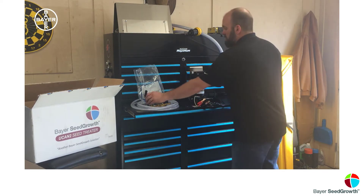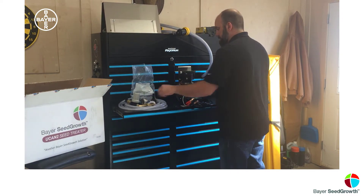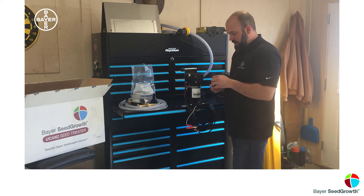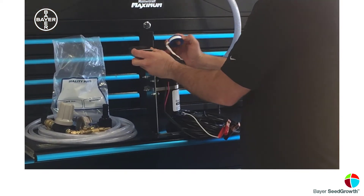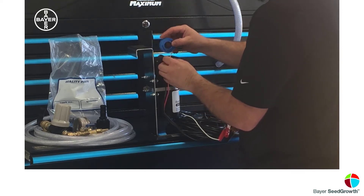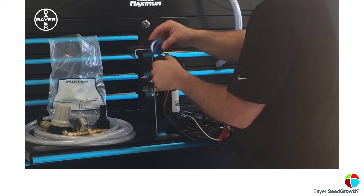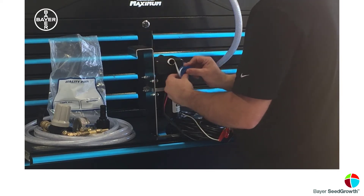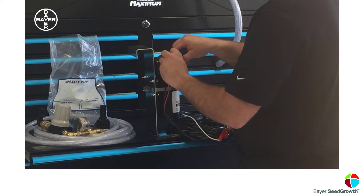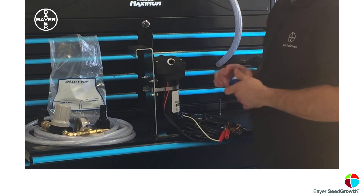The valve assembly, as you can see, it's all fixed. One little thing that a lot of people don't realize — you actually have to put 10 wraps of Teflon on this side. The reason is you want it to tighten up on you, and being that the orientation is kind of tough to do, the Teflon just gives you that wiggle room. So that's one, five, and ten. You want to make sure that you're not getting any extra Teflon around here — it could end up in your filter or back in the pump if it circulates.